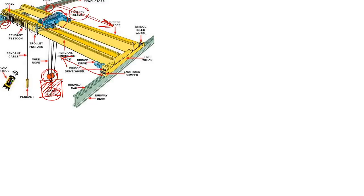The third component is these two beams or joists. Their function is to support the trolley — the load is transferred from the trolley to these beams. The fourth component is that these two secondary beams rest on the primary beam, beam number one on each side. So now you have an idea about the gantry girder and its function.